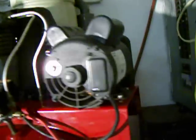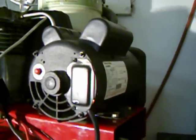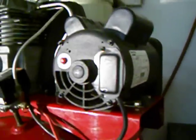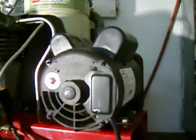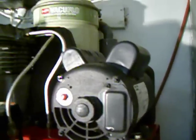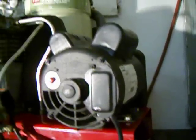I bought this unit and it works off a single 20-amp 220 breaker, which is more than enough power to supply this motor. They call this a 7-horsepower peak, which is really a marketing thing. You can't get 7 horsepower out of a 20-amp breaker, so it's really probably a 2-horsepower motor, but they call it a 7 peak.